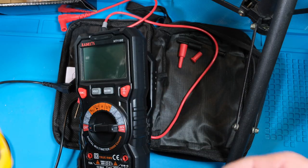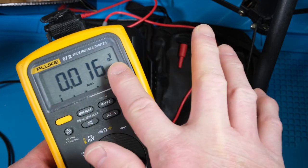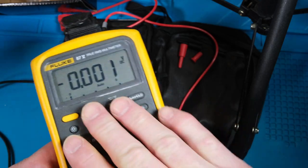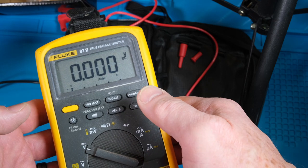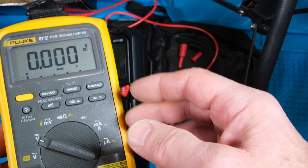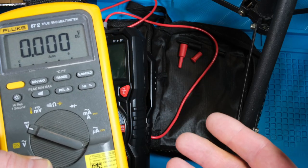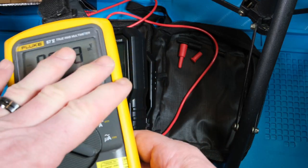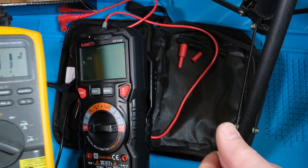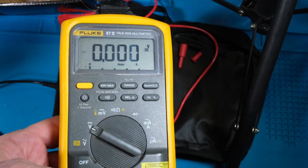Really, as far as the shielding thing goes, I haven't run into an issue before. If you're in environments where there's lots of radiation, you're going to have to do something. Meter leads are pretty long, so if you're up next to something putting off some magnetic or electric field, you can clip the meters on to what you want to read and then move the meter away from the instrument. Just wanted to point out that even when you've spent a lot of money on an expensive meter like this, the shielding isn't perfect.